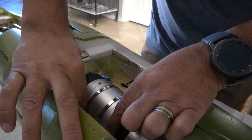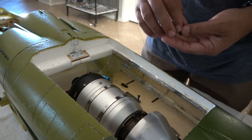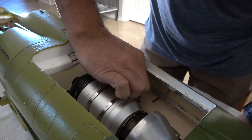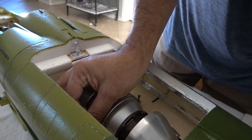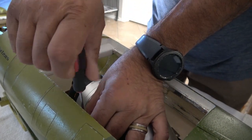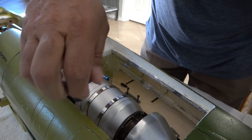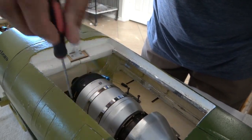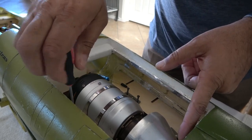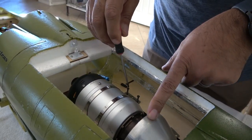Now, you're wondering if the pipe-to-turbine distance is set correctly. This one already had this same engine installed — just a different serial number — so I know that's been checked. The very minimum you want is about 0.75 inch distance between where the pipe begins and the end of the tail pipe of the actual turbine. That does not mean the cone, just the beginning of where the actual pipe begins. Optimal is about an inch to an inch and a half. This one has an inch and a half on it.